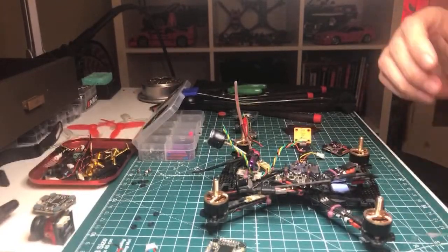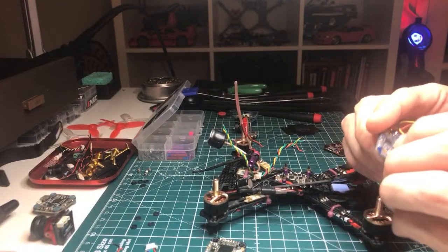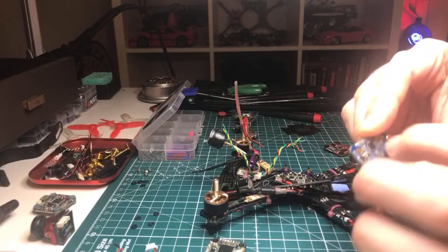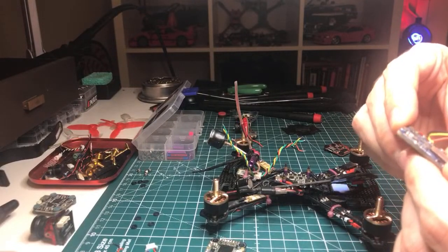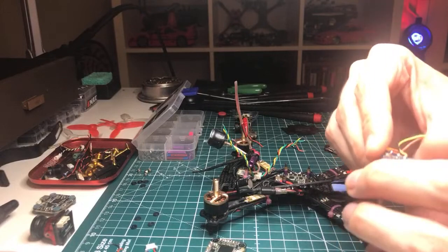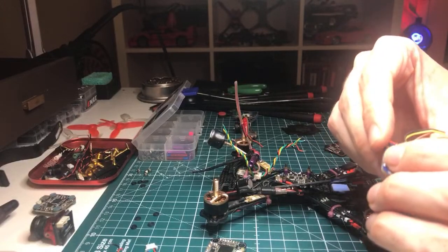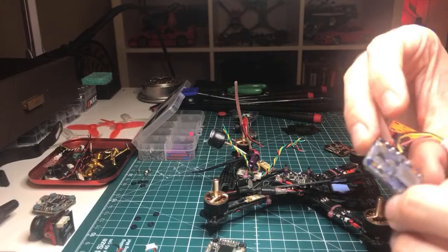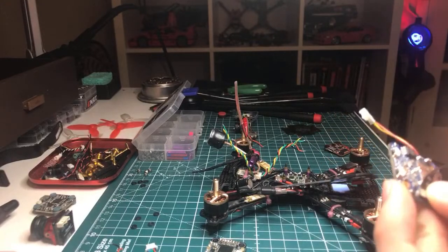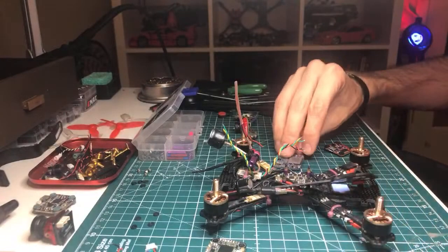Instead of epoxy, why not hot glue? I just didn't think it would be hard enough. To be honest, I didn't even think about using it. But now that you asked that question, I wouldn't have used it because it's got that gumminess to it. Yeah, it'd probably work. I don't know. Tommy said he used to epoxy stuff and it worked well, and epoxy is easy enough to work with that I just said to hell with it. There's kind of no reason not to, as long as you don't get it on those spots where you don't want it. It doesn't matter that it's permanent. If I ever need to get at this part of the board, it's over. I can't solder to any of these tiny little traces. It looks like on this board I only did one side, which is fine. In theory, that's a 50% better chance that it won't implode.